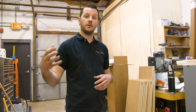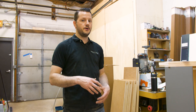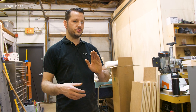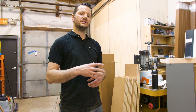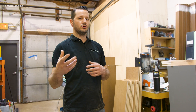The surround of these cases — the sides, top, back, etc. — have already been installed. We went ahead and installed them early on because we're going to have a 90-degree transition from plaster to our cases, and they're all going to be painted the wall color. We didn't want any seams there, so we installed a mud flange directly to the edge of the case so we can plaster right up to it and paint the entire thing the same color on site. It's a detail we've used several times recently and it provides a really nice clean streamlined look.